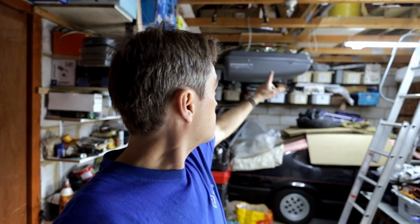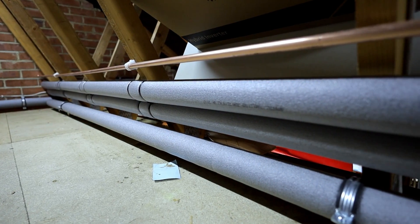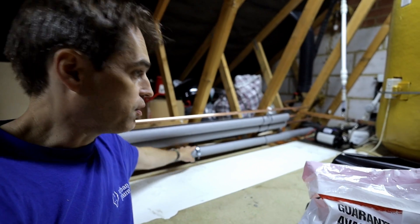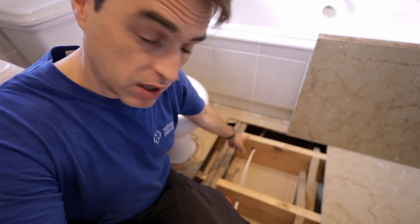I don't have mains water in the garage at all, so I'll have to go all the way across the garage, over the ceiling, into the house, and pick up mains water there — luckily there's a rising main going to the loft somewhere behind that wall. So this is our flow and return to the unit, and all my pipework terminates right there: main supply to fill the system, hot water, cold water vented, and flow and return pipework in 28mm.